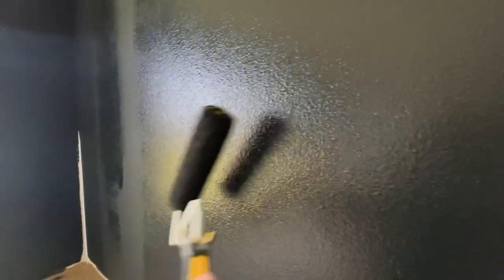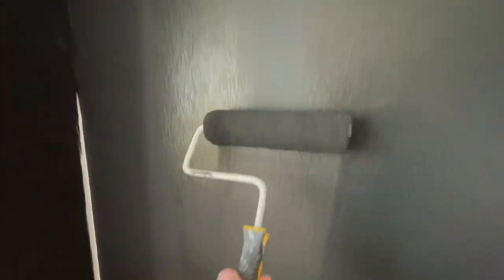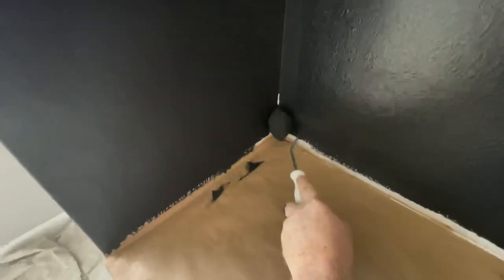Now come to the side and look at that. You don't see any of this. That's what you're going to get if you leave that on there. All the way up, all the way down — 50% overlap. All the way up, all the way down. And don't kill your corners; your roller can't get in there. Since we're using a roller anyway, we're going to take another roller that leaves the same stipple and get right in the corner — up and down roll, all the way up, all the way down. That's it. And that's how you roll out a wall.